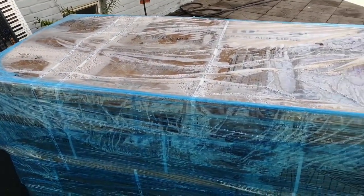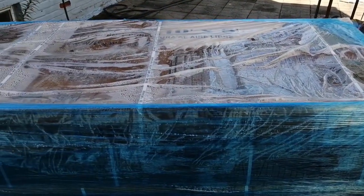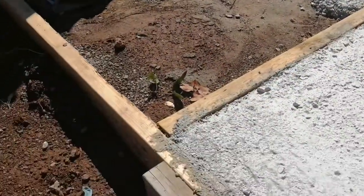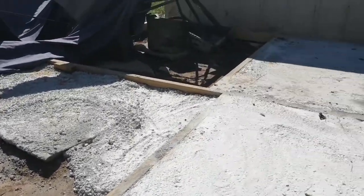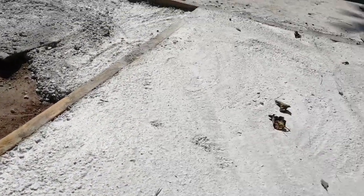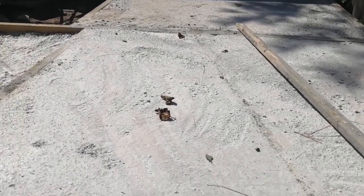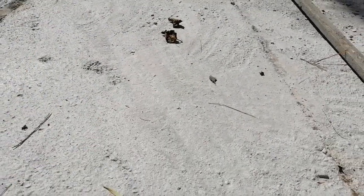What I need to do to start is build a foundation, and I opted to go with a cement foundation. This is the cement foundation I started building with my sons — it's using two-by-fours, about 11 by 9 feet, and four inches deep. I leveled it based on the frames and filled everything with cement. I'm not a professional, so it's not that smooth, but it has a liner on top from the shed and I built a frame around it.